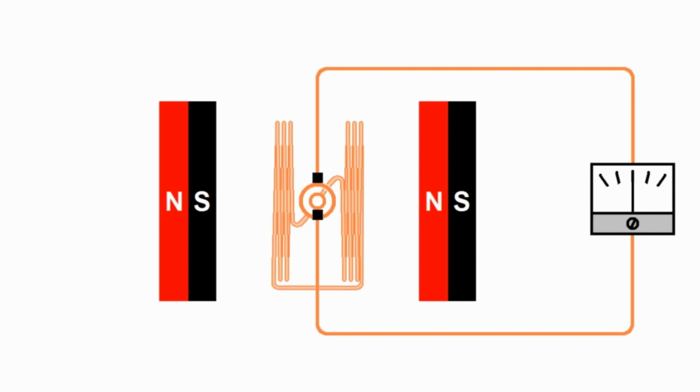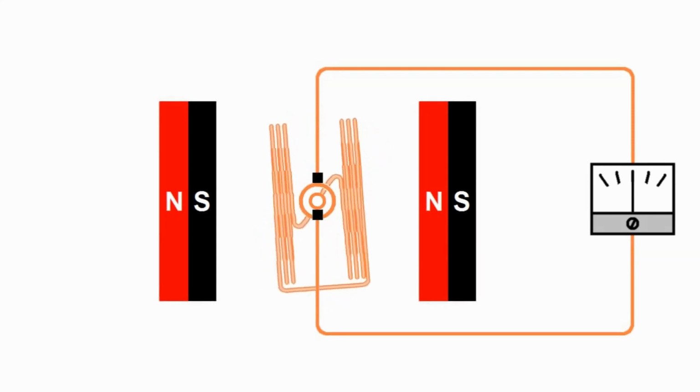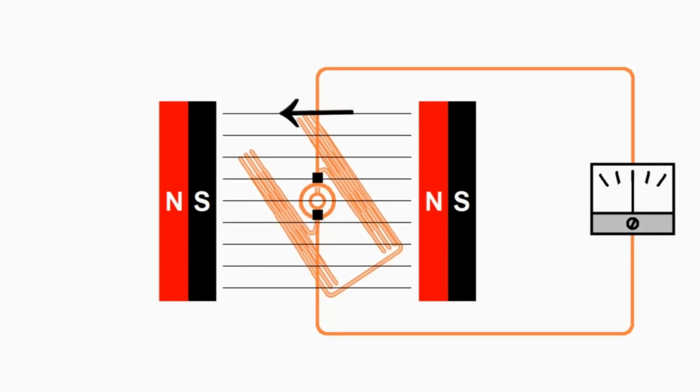Now look at the way the armature is wound. The wires that we see going across our vision or up and down are never going to rotate through the magnetic field in such a way that it'll create a great deal of electric current. But the wires at the top up here are wound away from our vision, so they're going away from our eyes, and down at the bottom they're coming toward us. And those wires are oriented in such a way that when they're moving in this direction, they're moving along the magnetic field and they're not producing much current. So look at the meter over at the right, and the needle is straight up and down indicating 0 volts. So the meter shows us positive voltage to the right and negative voltage to the left, and straight up and down is 0. So as the armature is moving in this area, we only produce a small amount of current.